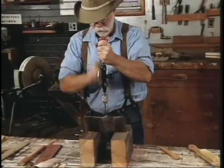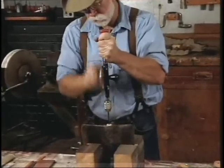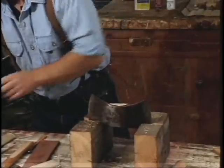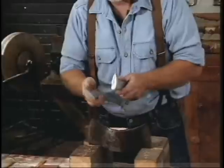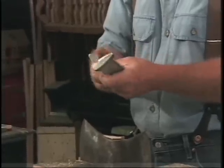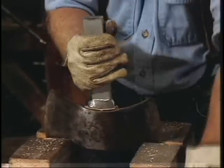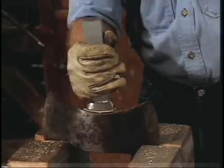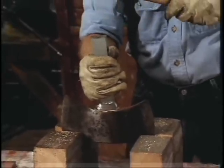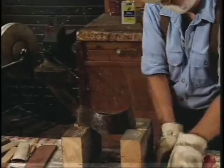The tools to use on this are drifts or swedges. This one's for a single bit — you can see the shape of it is like a single bit — and here's a double bit. Put it right on the top like this. Take a hand sledge, about a two-pound, and start to drive it out. There it goes — and we're clear.